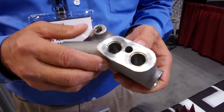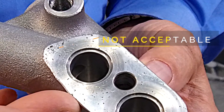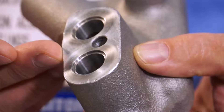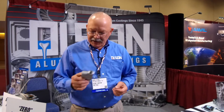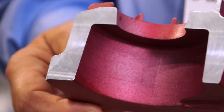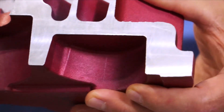Some of the issues that are typical of castings — oftentimes you'll see porosity that looks like what you see right here. This is actually a fuel valve, and this is typical of what many foundries produce and say is good enough. This part has to be 100% leak-tested and impregnated. We took this project on, eliminated that type of scenario, and we now have metal that looks more akin to what you see here: free of voids, free of gas, free of any type of shrinkage porosity.